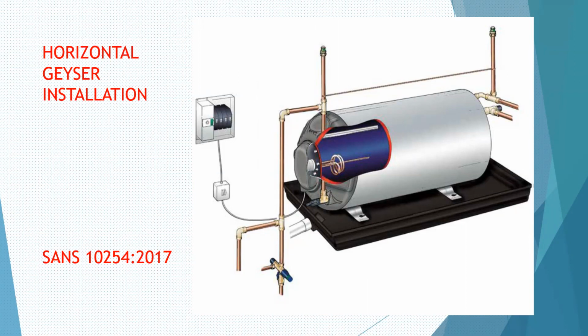So you have created work for yourself now for future by going to install the box for the balance side. You've already installed a non-return valve, and obviously you're going to have to replace either the mixer or the cartridge. Now, guys, the benefit of this is that you have saved a lot of time, because there was no need for you to go inside the roof. You know that valve works. You can see that from the gauge, and you don't need to replace that.